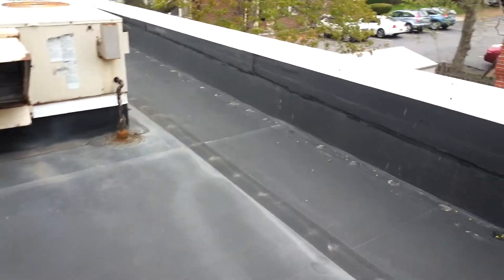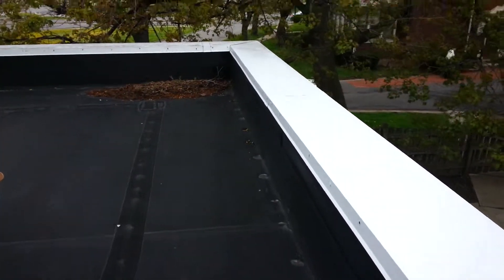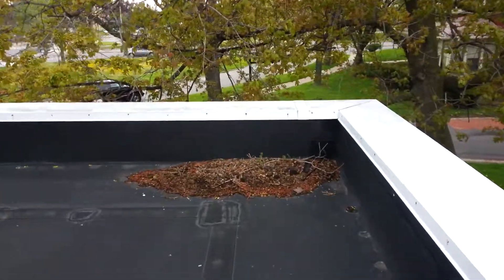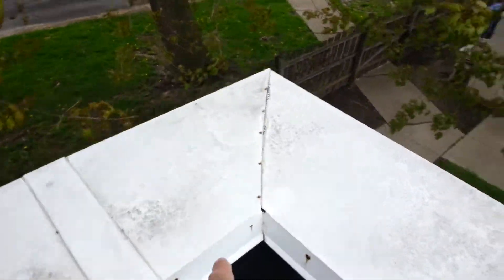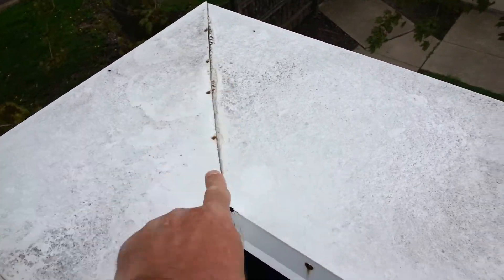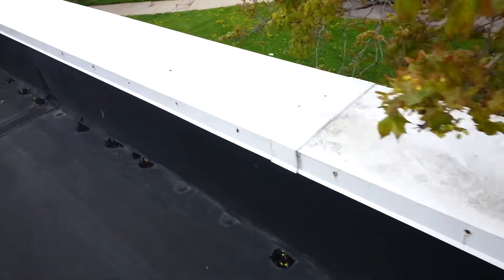And if there's problems on the ground, then there's problems on the ground. All of these caps are leaking — all of these caps are getting water into them. Over on the west side of the building, all of this caulking and everything is all gone, so water's coming in between the roof line here.